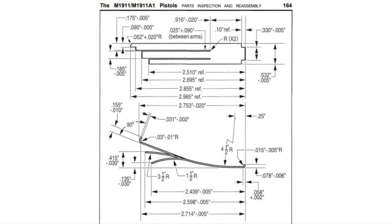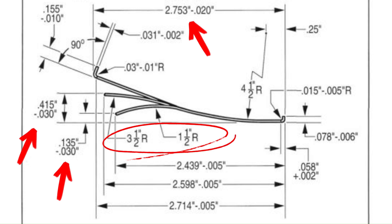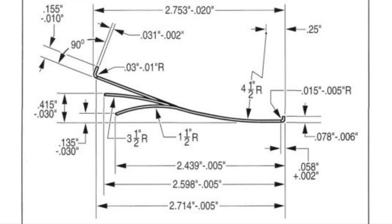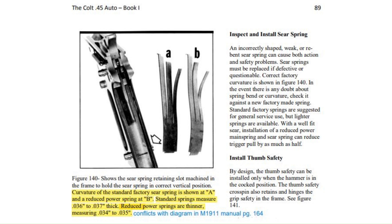Here is a transcription of the original 1911 sear spring diagram from the M1911 manual by Jerry Kuhnhausen. The top view is the flat pattern before it is bent into shape. The bottom diagram of the bent sear spring shows some interesting dimensions, geometry, and features. There is a call out for a specific bend radius of the spring, then some measurements further defining the forms and positions of the individual tangs. I tried to use this diagram to develop measurement points to quantify my sear spring adjustment, and that didn't really work — it got way too complicated and hard to measure. There are different kinds of sear springs that deviate from the original design, generally reduced power for lighter 1911 trigger actions.